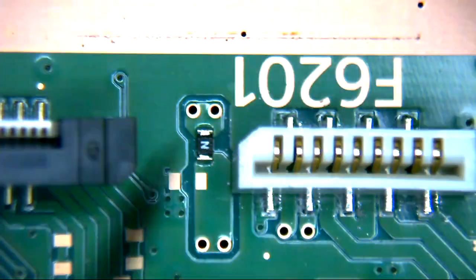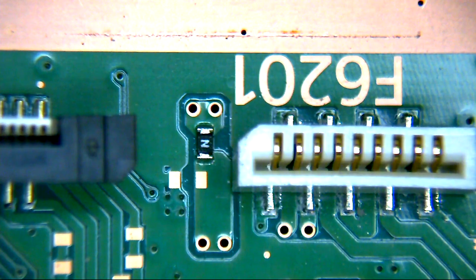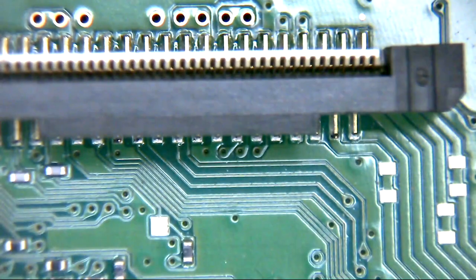Hope you can hear that. That's 1 ohm and dropping. So we've got continuity across all three of those fuses, and as you can see, we've not done anything major there. We've got no schematics, we've got nothing really to go on aside from an old logic board, and already we've managed to deduce quite a lot about this circuit that's in common with the older stuff.